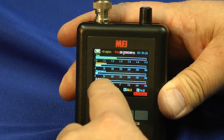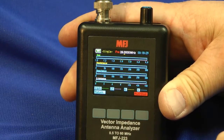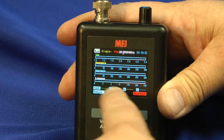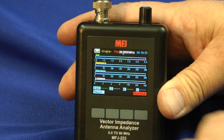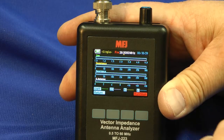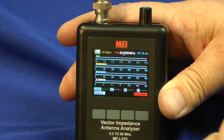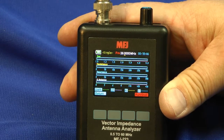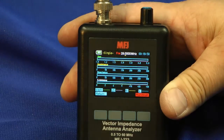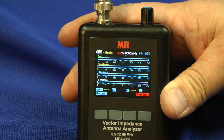Then we have what the DDS is doing here. Now, if I stop this, this is important. I have this little indication down here that pops up every once in a while — it pops up in red. That lets me know that if I have a strong signal nearby, that could be causing this instrument to have erroneous readings. How many times have you worked out in the field and you're really puzzled by what you've gotten on your meter, only to find that it's a local transmitter nearby? This will give you an indication if there's an issue.